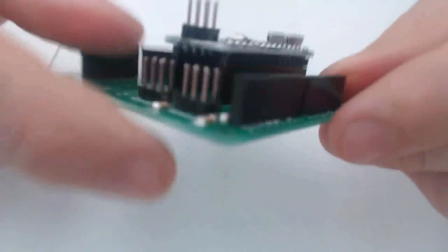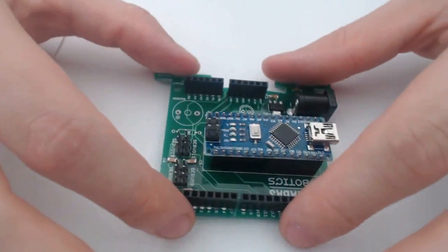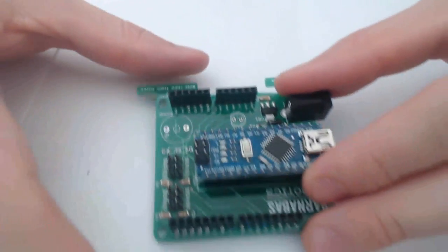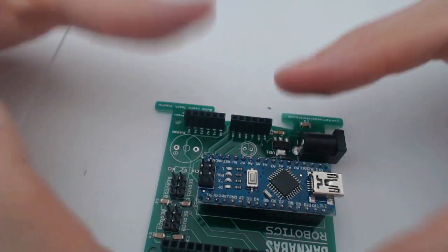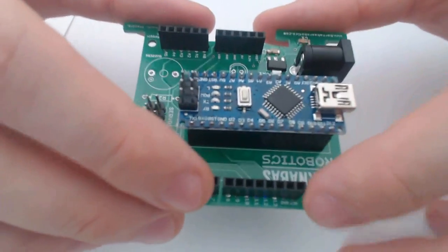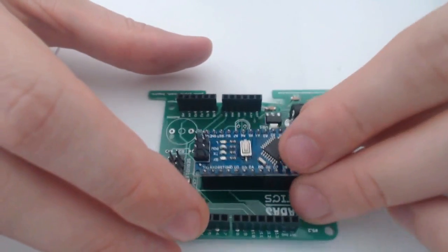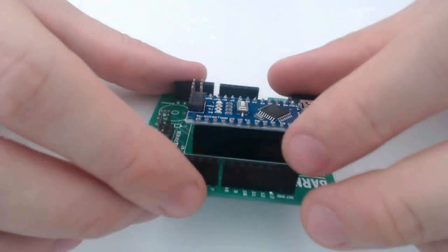And you'll notice this if your board is working for a little while, it's taking code, it's accepting code, it's doing what you ask it to do, and then all of a sudden, maybe like an hour into it, it's not accepting any more code. You're having issues getting it to do simple tasks like blink LEDs and things like that. That kind of tends to be a problem with too much flux being on the board. So make sure you scrub it.